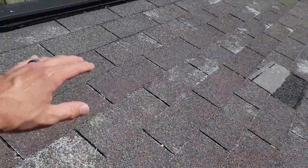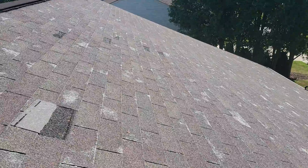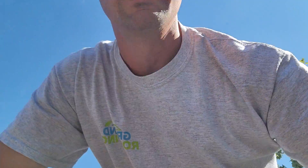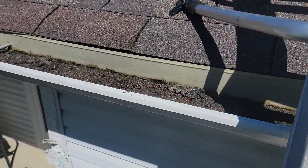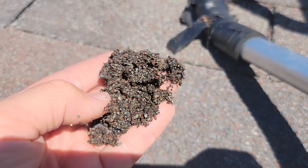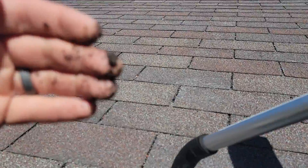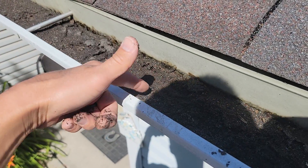Some other things to look for - let's look at the gutters. I recommend cleaning your gutters twice a year depending on where you live. We have a lot of maple trees around here, so clean them out when the helicopters come down in spring. If you observe granules in your gutters, that's an indication granules are coming off your roof and gathering in your gutter. Also clean them in the fall after leaves come down. Look right here - that's all roof granule wearing off the roof, running down in the rain, and gathering right here. That's a dead giveaway these granules are not where they're supposed to be - they're supposed to be up on the roof.